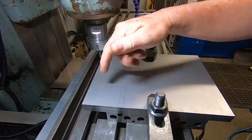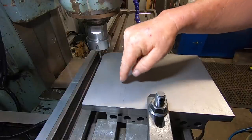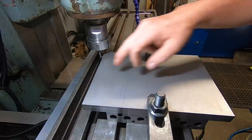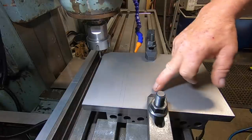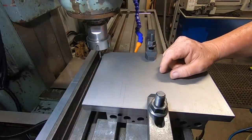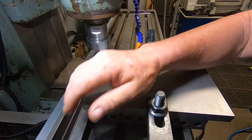So once this is all squared up, then I can work out my offsets for the three mounting bolts on each side for the pivot, and then I can take it all back off again and then fly cut the top, do the slots in it, probably three lots of slots for mounting slots at this stage. Still we have to work that part out completely, but yeah, we'll get this done.